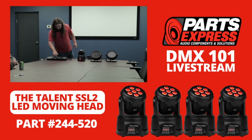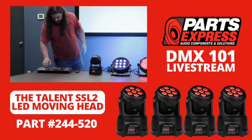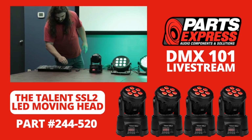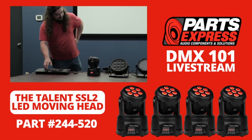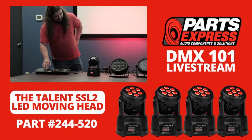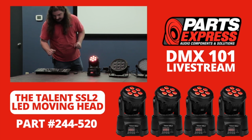So right now, as I was showing, oh, I'm in blackout. Right now, this light, let's turn all this off. Yep. So right now this light is in 9 channel mode. The first channel does the rotate, second channel does the tilt, third channel works as a dimmer until about halfway, and then it starts strobing. And the more I go up, the faster it goes, until you get to the very top and it's just full blast.